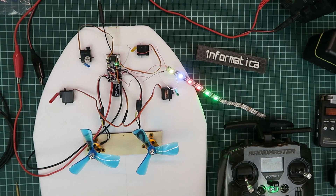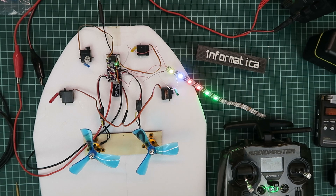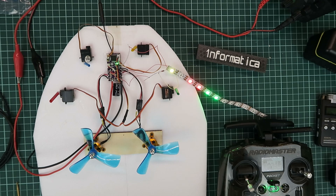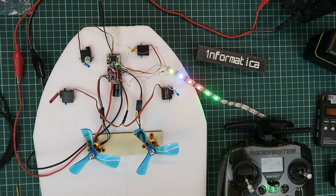I encountered an article on the Hackaday website — I'll link it in the description — which shows an interesting hack that essentially turns the first LED in the strip into a level shifter, incorporating just a single diode. The forward volt drop of the average diode is around 0.6 of a volt, so 5 minus 0.6 means we're feeding 4.4 volts to the first LED. 4.4 times 0.7 gives a threshold of 3.08 volts, which is well within specification, so the output from the MCU is able to drive the first LED.